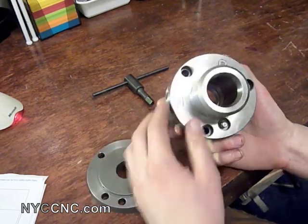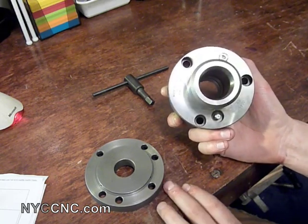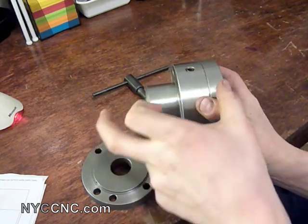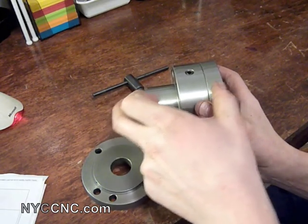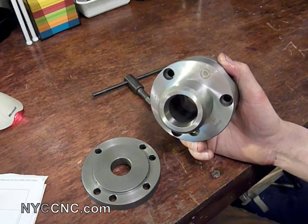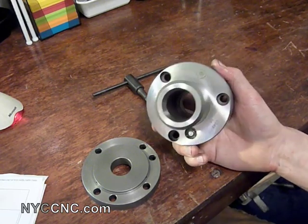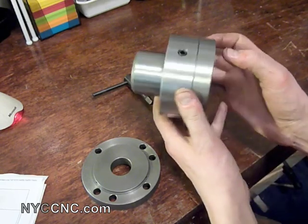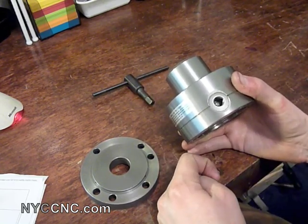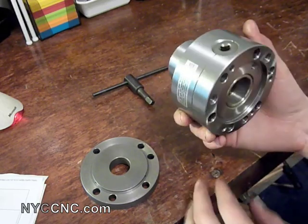Let me talk a little bit about why I chose this chuck. A lot of people end up going with the 5-inch version, but I opted not to because you don't lose anything with the 4-inch versus the 5-inch in terms of your capacity to use the 5C, but it weighs a lot more and takes up significantly more of your lathe cross travel or bed area. I purchased this from BrassandTool.com for about $350 — a significant investment relative to the price of the mini lathe. But the mini lathe is a very capable machine, and if I upgrade to a bigger lathe in the future, this should still be a quality piece of equipment I could use then as well.